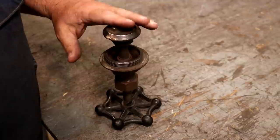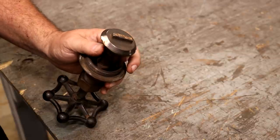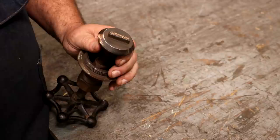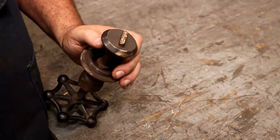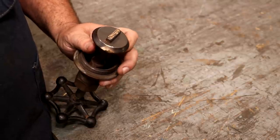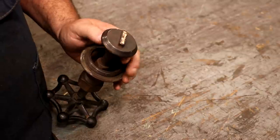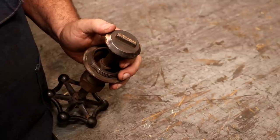You can kind of see this ring — it basically makes contact with the valve seat from about there on out to here, but right here there's just not enough material to make good contact to seal that up. First thing I looked at, I was assuming this was going to be a bronze or brass valve seat. But we got looking at it and it was shiny metal, more of a white metal. Took a magnet — magnet wouldn't stick, so it's not steel. This material I'm almost 100% positive is a material called Monel, which is a nickel-based material similar to Inconel. Monel was commonly used in valves because it's corrosion resistant, and it was very often used in steam valves, even going back a long time ago.